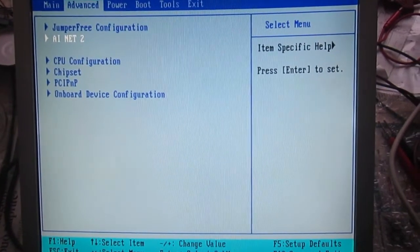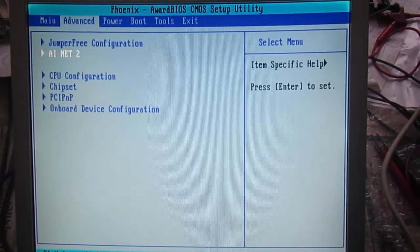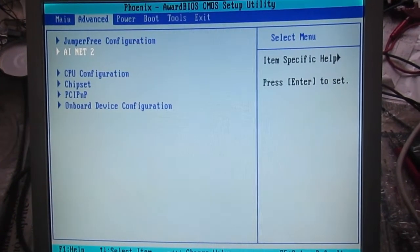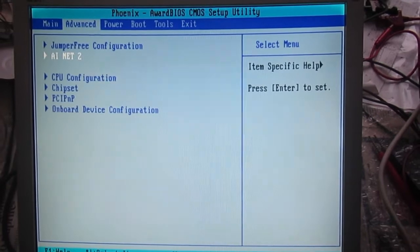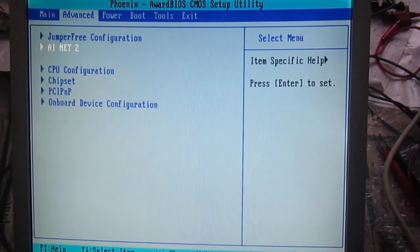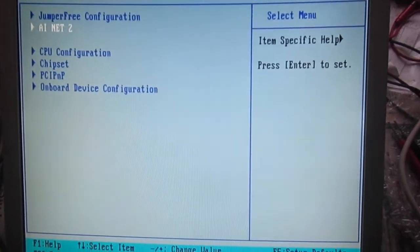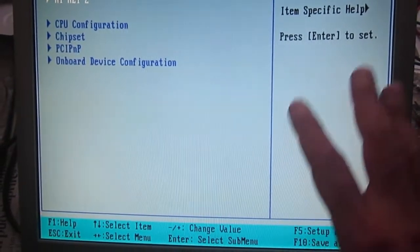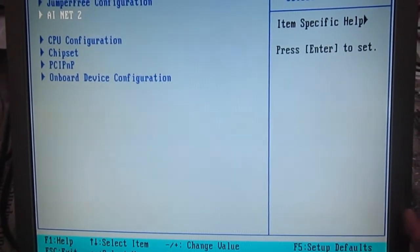So the monitor appears to work fine, and you may wonder why that diode failed in the first place, but I don't have a good explanation. It may be just that it was time to fail. It's not under-designed either. It is two diodes of 10 amperes each, so it's not easy to fail on a low power device like a small LCD monitor.